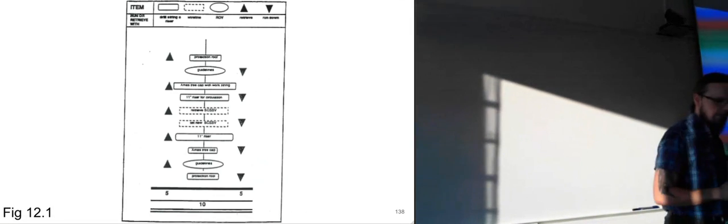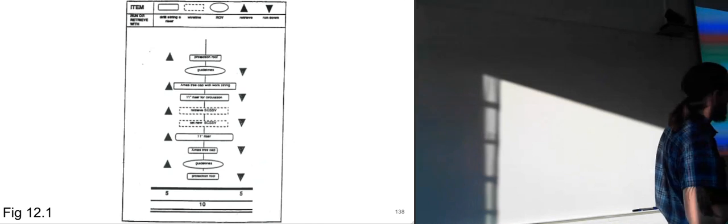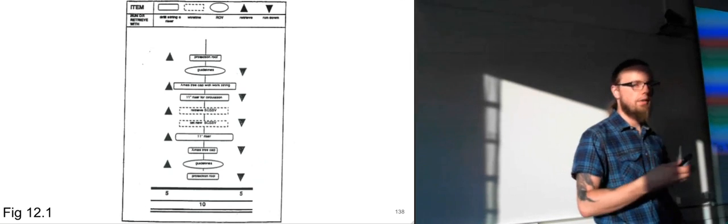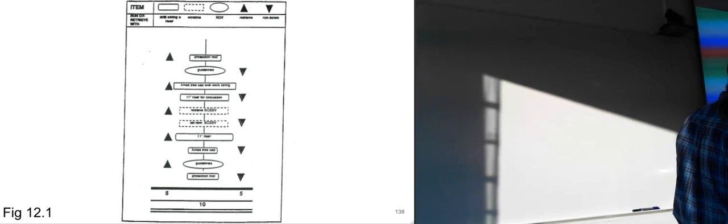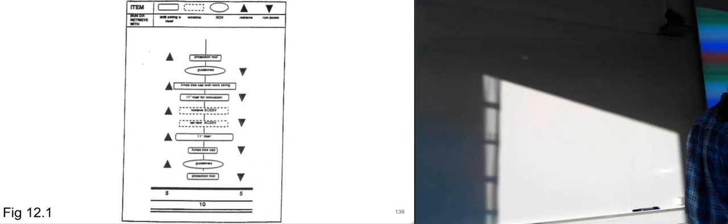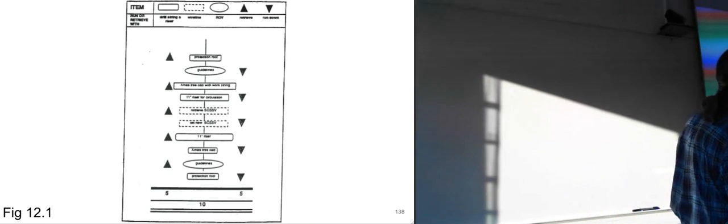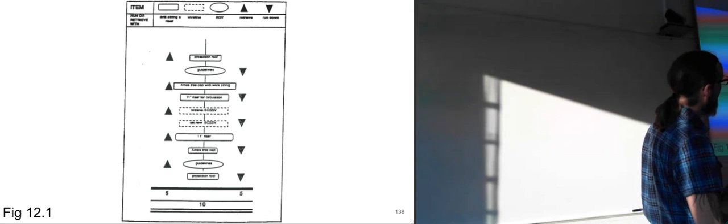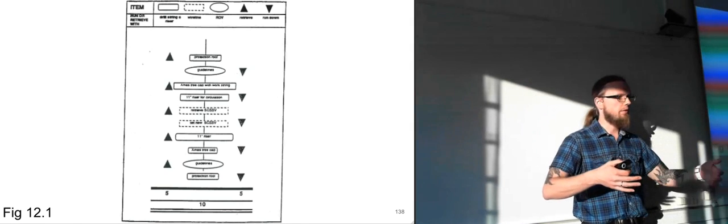This is one of the last figures in the appendix, and it's showing the necessary sequence of doing a retrieval like this. In this case, they're going to go in with wireline equipment, and they're going to exchange the surface-controlled subsurface safety valve. So the first thing they do is remove the protection roof of the protective structure.